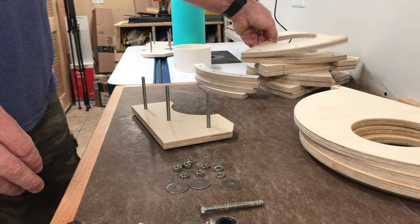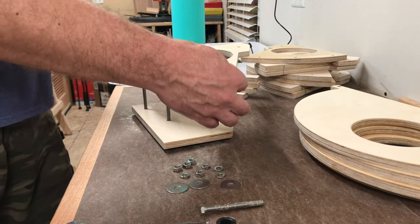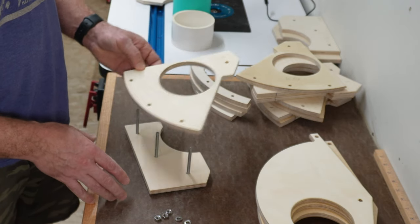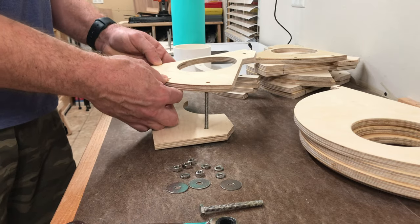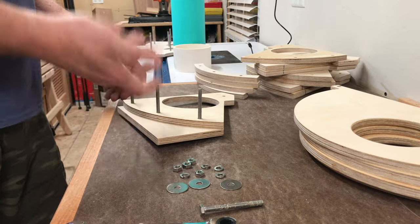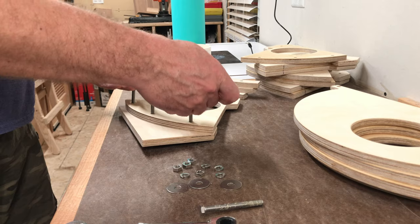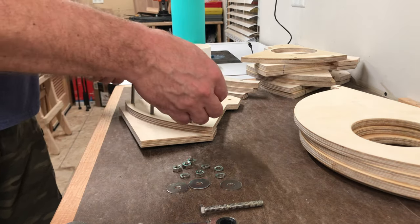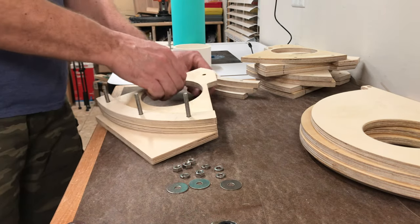And this wall mount piece has no wax on it at all, and we're starting with the tool side, as I have labeled here. And then we'll put our first flange piece, and there is kind of a left and a right to these. The holes are not exactly symmetrical, so one way fits better than another, and that's by design, because the big holes need to line up with each other. Don't force it. It should go on pretty easily. If you're having to force it, you might have it reversed. And then the spacer piece will go over those bolts. Again, there's kind of a left and a right to these, so make sure you don't have it flipped. And I've only waxed the inside edge. Put our pivot bolt in.